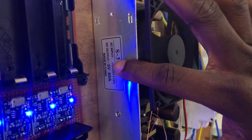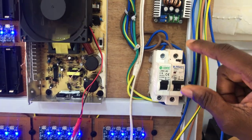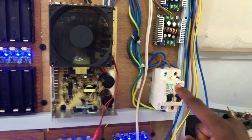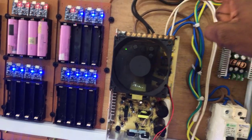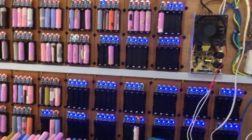This is essentially 300 watts. Over here we have the breakers. The AC power from the socket goes into the first breaker, then from the first breaker it goes to the power supply. The power supply at 5 volts and 60 amps then goes through this breaker and on to the board. That is how this whole thing is wired.